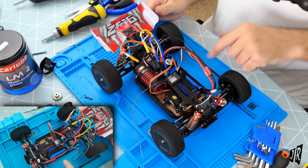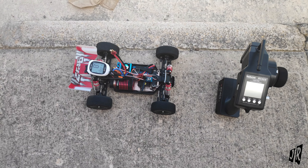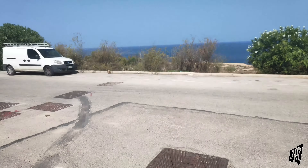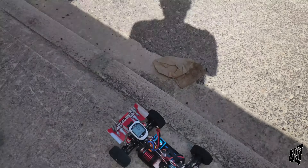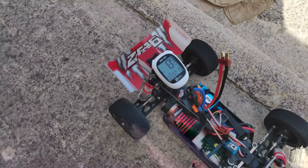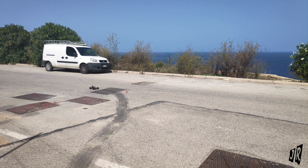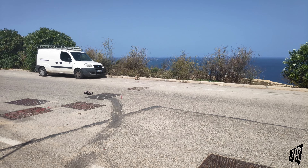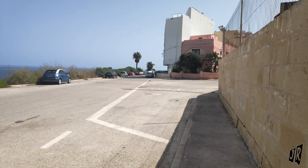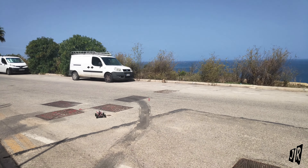No, that's fine, it's fine. Right, now everything's in place - oh, that's fallen off already so that doesn't work. Let's do a quick test while we're here without letting these wires touch for obvious bang bang reasons. Stay apart. This has to go into channel number two with the black - so you've got channel one, two, three, four - it's the second one down, black on the right hand side. Now the servo - I believe, I can't remember - so we're just going to try it this way and if it doesn't work we shall try it the other way.